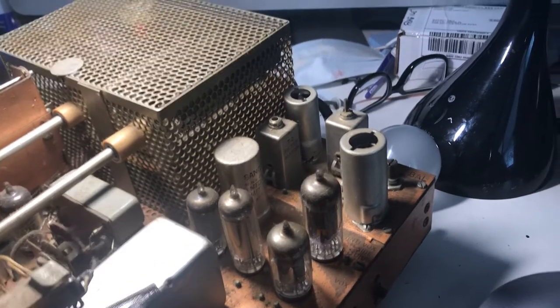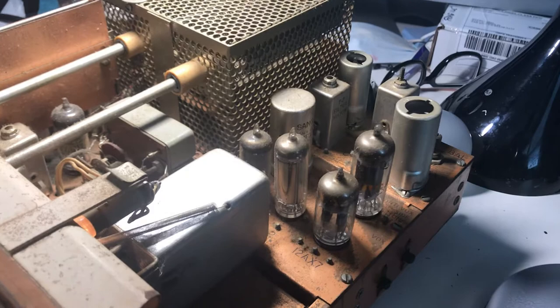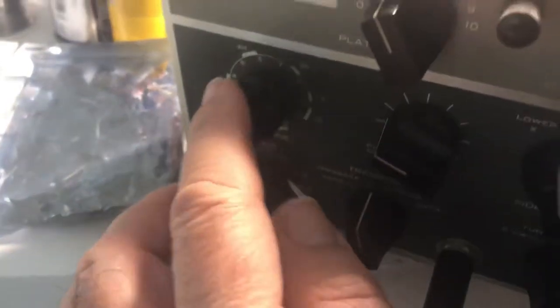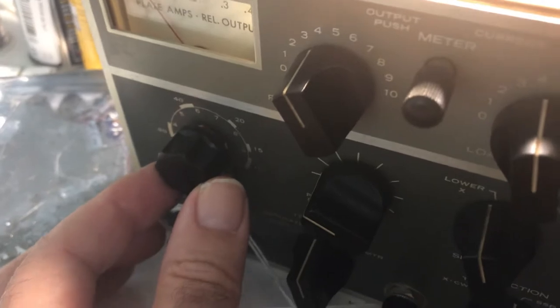This one works pretty good. I'm really impressed with it. I didn't have to do much — just replaced that resistor and it pretty much came back to life. Somebody did goof up the mechanics of the pre-selector for the drive selection, so that's not doing too well. But besides that, it's in good shape.